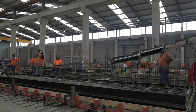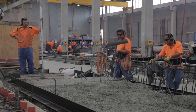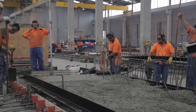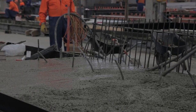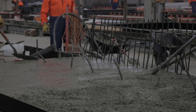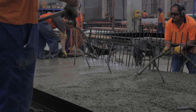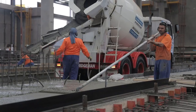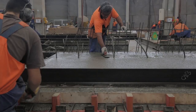Once the concrete has been poured into the moulds and spread around to fill all the spaces, it needs to be compacted. Usually this is done with an immersion vibrator, and it's important that it reaches all the concrete with no points left un-vibrated. The compaction should be done systematically in an organised sequence throughout the freshly laid concrete, not randomly. Each area should be vibrated for about the same amount of time, and the vibrator shouldn't be left in any place too long. Once compaction is complete, initial screeding should happen immediately to spread and level the concrete surface.